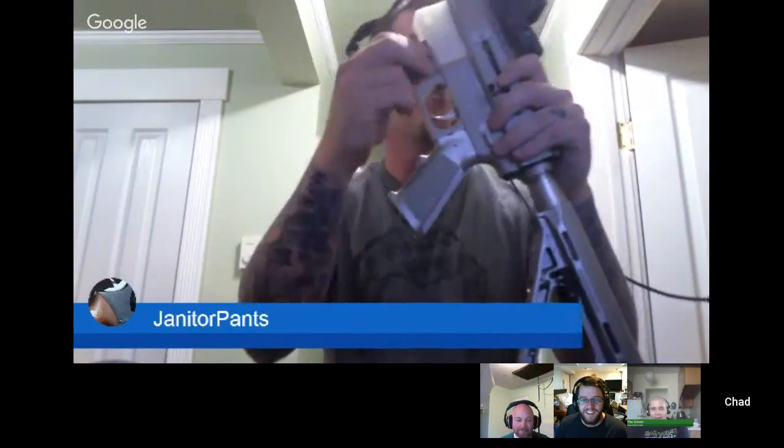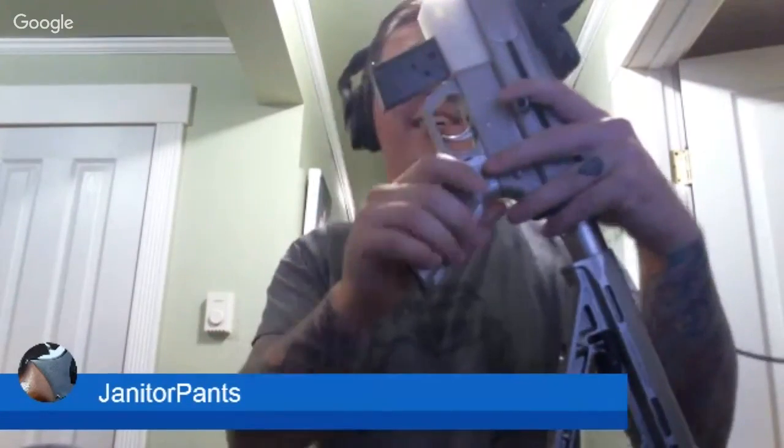What did you guys do with guns recently? You got anything for show and tell? Yeah, kind of, I guess. Still in the works, but check this out. JR carbine, 7.62 by 25. Got the mag block fabbed up. And she strips rounds, so I'm working on the mag catch right now, and if that works out, she's getting a barrel, and maybe this will be a thing.